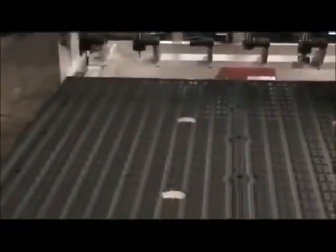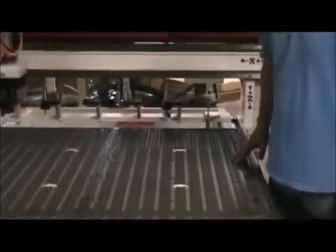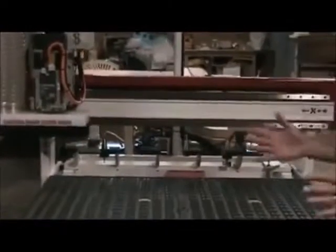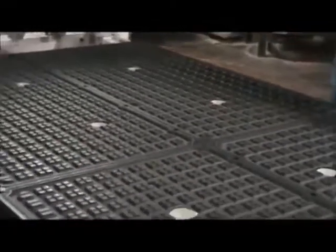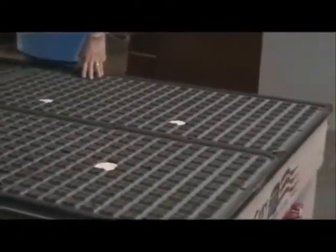What's the material — is this phenolic? Yes, it is. And we do have helicoil inserts here for attaching your different zone boards if you want to attach them to the table. We've tried to think of everything, Kevin. We also do a two-zone vacuum plenum, we can make custom plenums, we do an aluminum T-slot table, and we also just do a flat phenolic machine table with or without helicoil inserts.